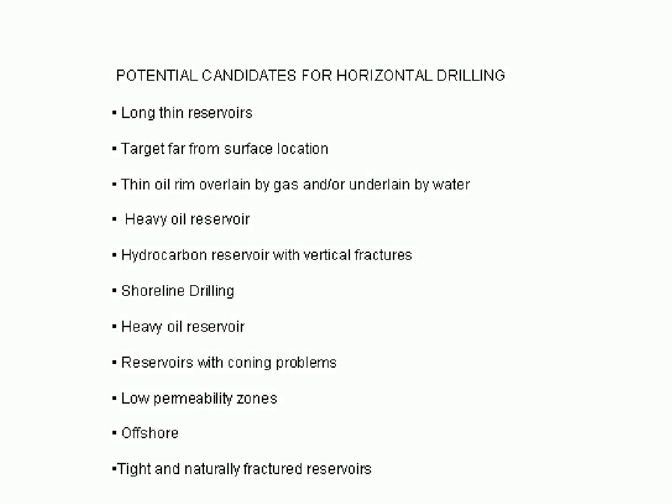To achieve maximum production from a horizontal well, the simplest form of well completion is running and cementing the casing just above the producing zone and drilling the pay section with a non-damaging fluid. This is to achieve a good bond between the formation and the casing, and to prevent the fluid from entering the producing zone. Additionally, to ensure optimal well production, it is important to properly control the fluid injection rates, and to ensure sufficient fracturing or gravel packing of the formation.